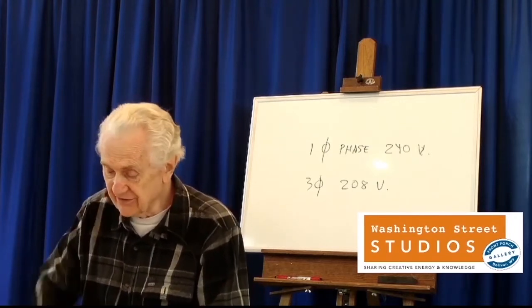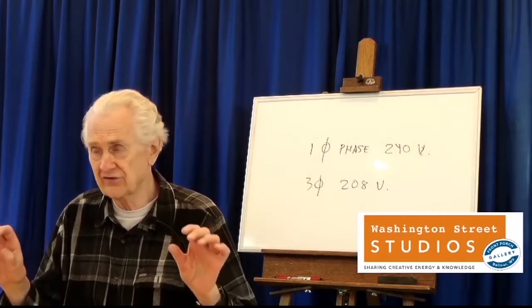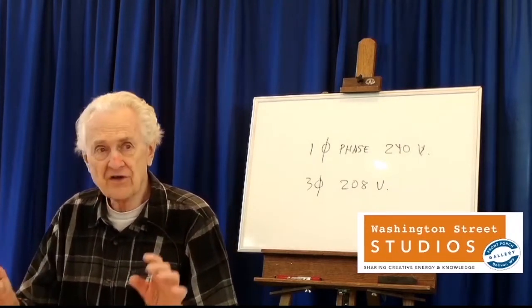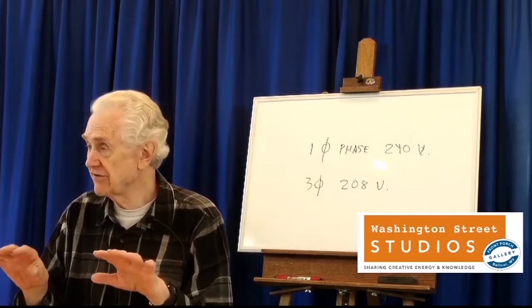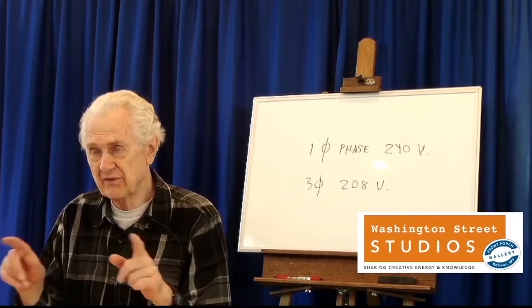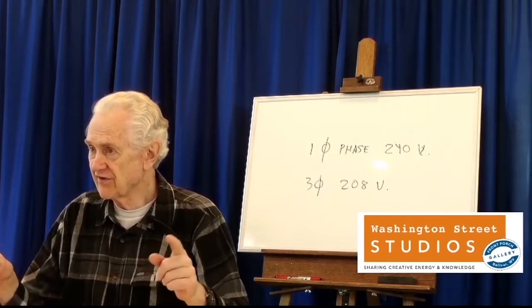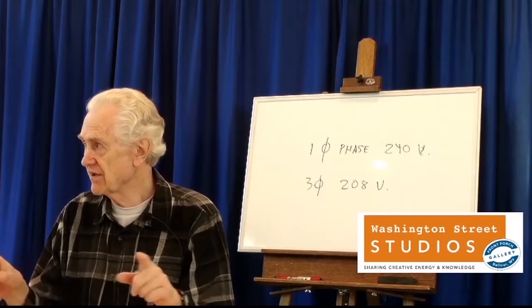I look at the elements to see, first of all, are they in place in the grooves or the holders on the wall? And also, are the coils of the elements evenly spaced? Because if the coils have gotten unevenly spaced, it means that either they've been replaced and they haven't been replaced properly, or there's something going wrong with the way the kiln is operating.